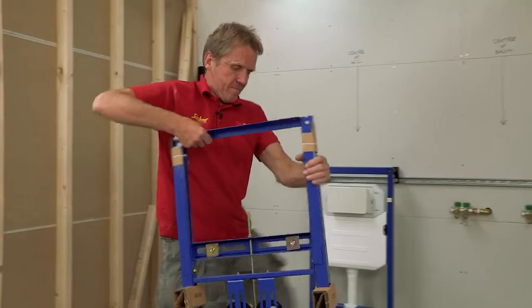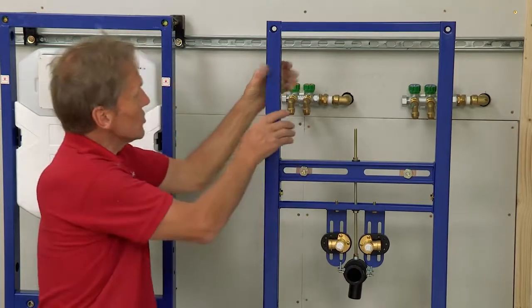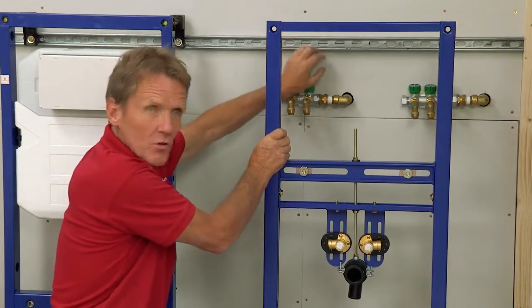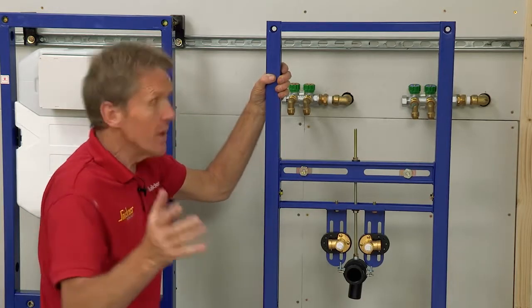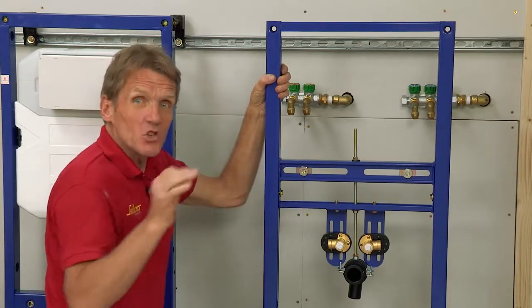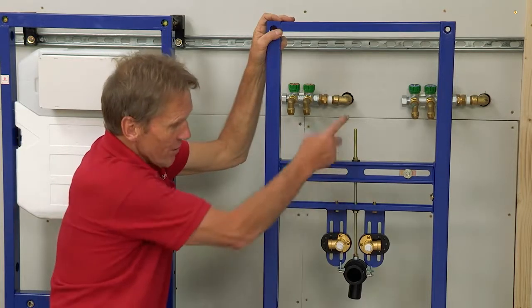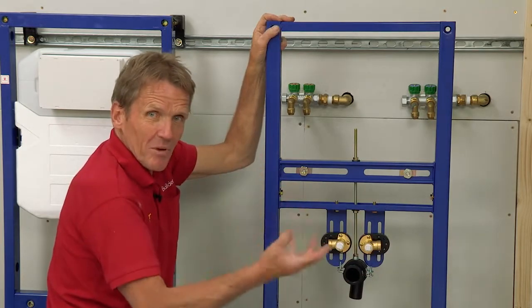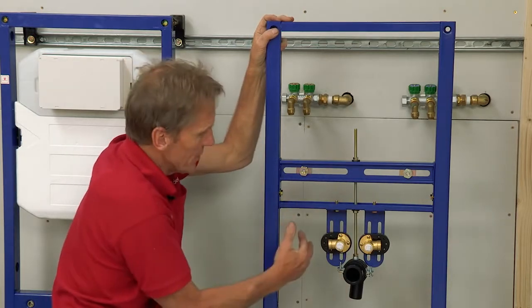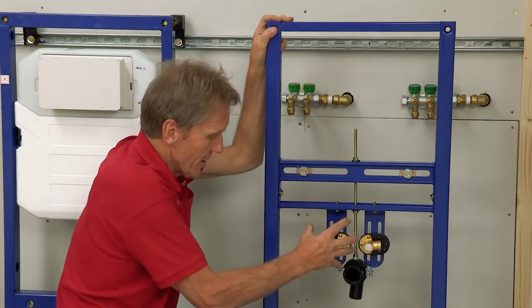If you've got your basin on hand, there's nothing complicated about the job. Because we're fitting this next to a WC frame, we're going to use the same bit of unistrut to hold it to the wall, giving a really secure fixing. If you wanted to put it in a cloakroom without room for a full wall, you could move this back as close as 100 millimetres to the wall. There's adjustment everywhere on this frame — we can rise and fall on the waste outlet and adjust the inlet position to accommodate a chrome trap or a pedestal.